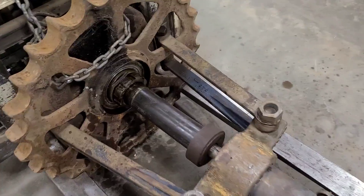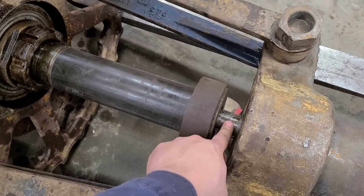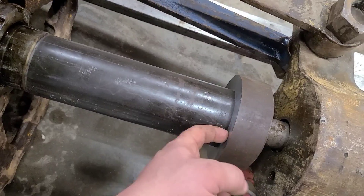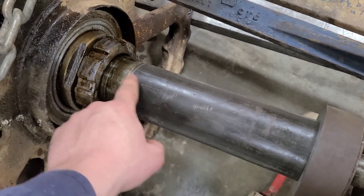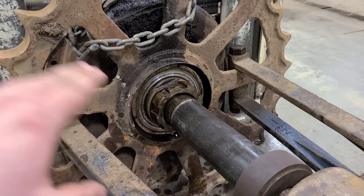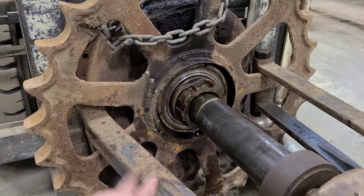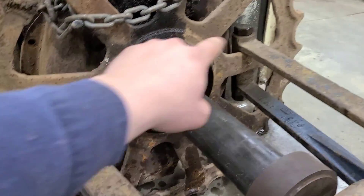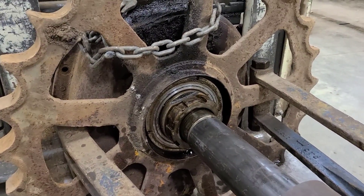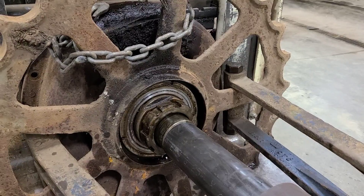After a little machining, I had to make a spacer pipe in here, and then this is just a puck to go from the little to the big — from this small solid pin to a hollow pipe. That's just a piece of solid I had laying around. It worked out pretty well; I just had to machine in a groove so this sits in there. This just happens to be the same 3-and-a-quarter-inch size as that. We have the fingers in here. Now these are an odd number of spokes on these sprockets, so what CAT does is on this one you'll grab two, and on that one you grab just the one, as the illustration shows in the manual. I can't get these much farther in — we're hitting the housing — so I assume that's all you get. We're going to put a little tension on it and see what happens.